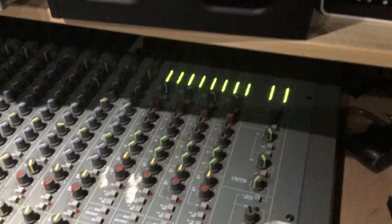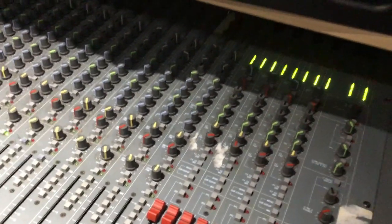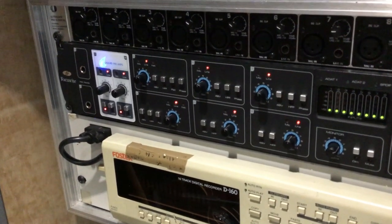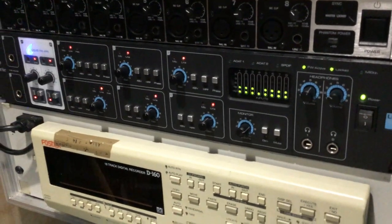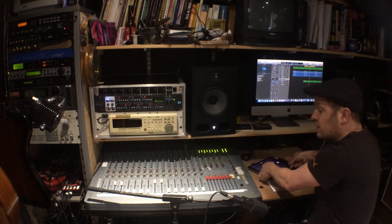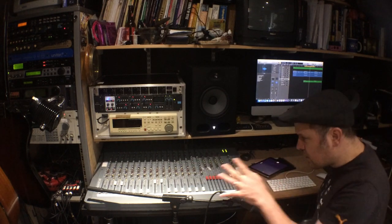It's outputting the same thing on eight bus outputs. The bus outputs are jack on this mixing desk — I've wired up an eight-way jack loom that goes to the input of my sound card. On the Focusrite, all the inputs are set to line and I've got metering there, essentially showing that I can record on any of the eight inputs on the computer. You've got to be a bit careful seeing where things are switched because you don't want extra noise.